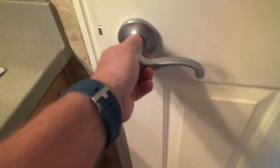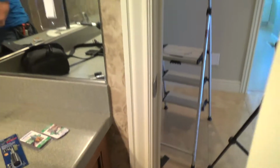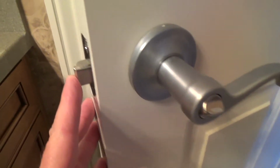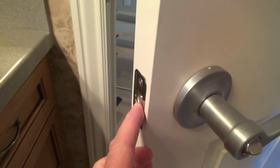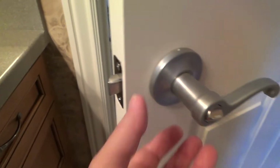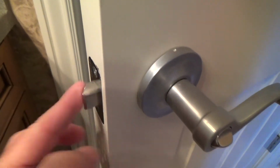Or you might close the door and pull on it and say, hey, it's not working. There's something wrong with the strike plate. But maybe in fact your latch is sticking. I've had that happen before, where you push this in and it sticks. Then you've got to pull the door knob apart, spray some WD-40 in there, get it all working. Lots of times that's all it is. Or you might have a broken part in there. So it's not always the same thing.